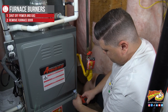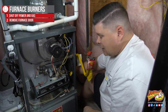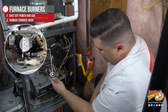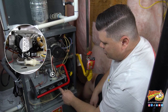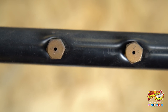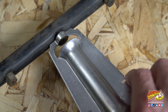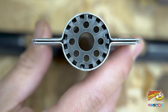Now we're going to take the doors off the furnace. This is going to expose the burner assembly. This is the gas valve, and this pipe that flows around here is where the gas travels through. On the other side of this are the orifices that the gas is being pushed through. The jets have an opening, and they sit over that. The gas goes through, they're ignited, and they burn into flames.